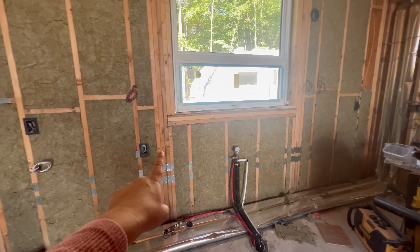I only have an hour left of my day. I'm getting up on the ladder to continue — there are fewer wires higher up but I'm still having to cut the insulation in half, tuck the back half behind the wire, and put the front part on. There are a lot of little spaces that are going to be a pain. Things I wasn't thinking about during framing caused issues during electrical, and things I wasn't thinking about during electrical are causing issues during insulation — I think this is why all the trades don't like each other.